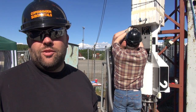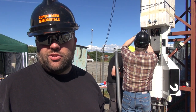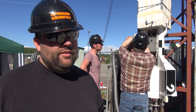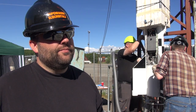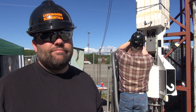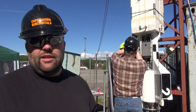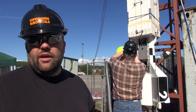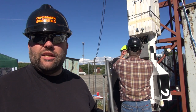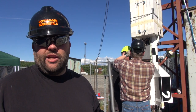This is somewhere in the middle of the second cold flow test and it looks like we only have two leaks left. We have one in the top of the LOX tank just next to the vent valve - that's just a threaded connection that needs some new Teflon tape and a good tightening, then that one should be done. The other one is a bit more precarious: it looks like it's the spindle seal on the LOX main valve. It seemed completely tight for at least 15 minutes - we didn't notice anything - and that's why we do these cold soak tests. We're going to try and fix this on site by pulling out one of the shell plates to get to the LOX main valve and tighten the spindle seal right here on the rail.